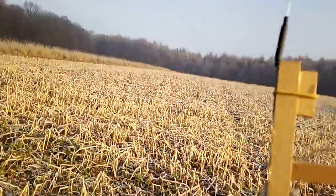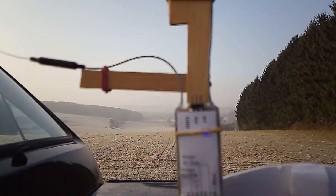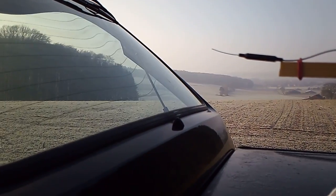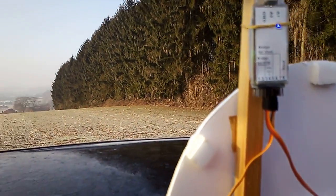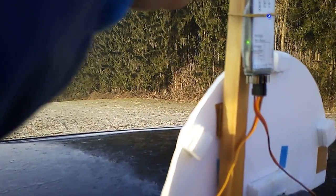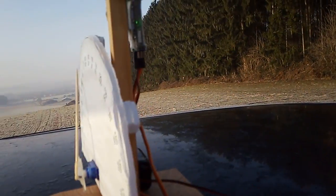I'm going to try the diversity test from the top of the car. I have to turn this around so I can see the antennas — which antenna is on. Now it's the vertical antenna that's on. I covered it and it passed to the other one — you can see the green one is now on. I take it out, and now I cover the other one — this should move to the other antenna. It's not moving, because it's not losing packets or frames, so it's not switching. You have to obstruct it more like this, so it moves to the vertical — but it's still not losing frames.